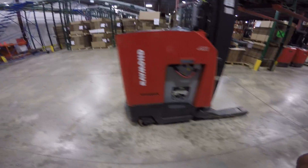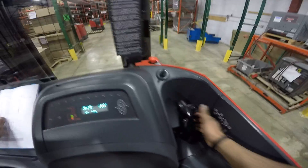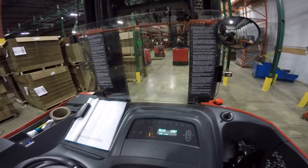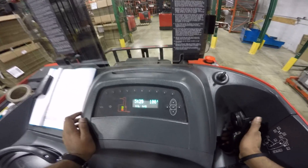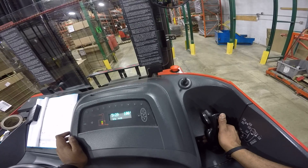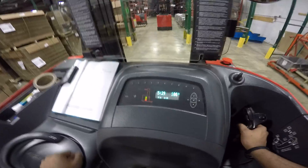Make sure all the wires are in place, and do a basic check of all the controls. We have a separate video on how to operate this machine, but quickly: use two fingers to push the fork in and out, and the thumb is used to bring the fork up and down. Before you operate the machine every day, make sure all the controls are working — shift side to side, tilt, forks tilting up and down — and the machine goes forward and backwards. Listen for any knocks, clicking, or any weird sounds.